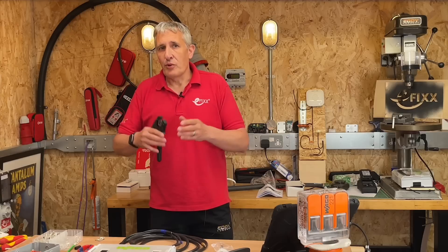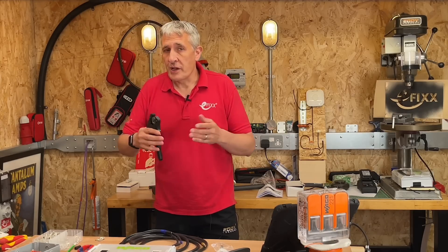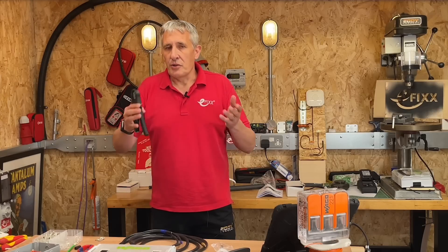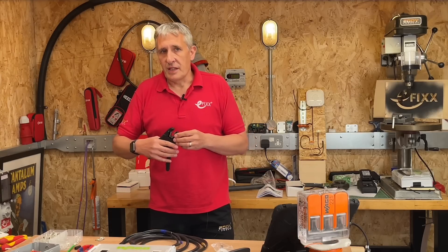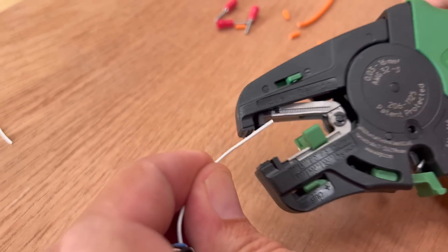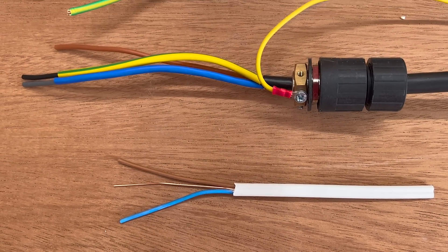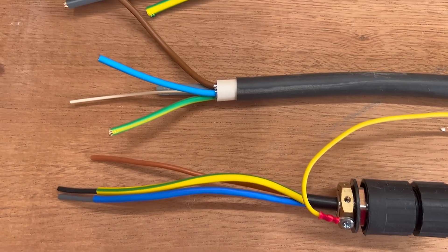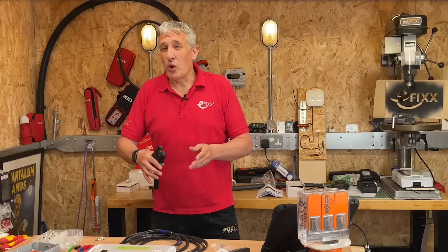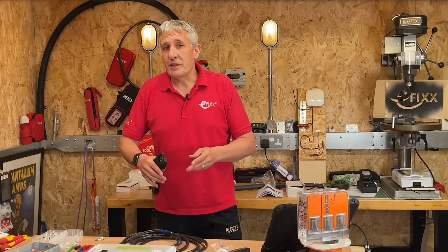To adjust, use the slider at the top, which applies a different pressure on the cutting blades for different thicknesses of conductor insulation. However, be cautious not to apply too much pressure, as it may damage the conductors in small diameter cables like security cables with thin insulation. On the other hand, if you apply too little pressure it may not remove the insulation, which is particularly challenging with harder materials such as XLPE. We often get asked about XLPE as it's a common insulation material used in armoured cables and low smoke cables, and it's always a real challenge to strip.